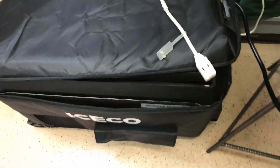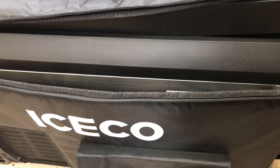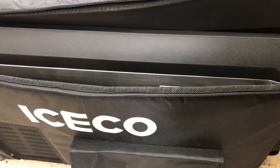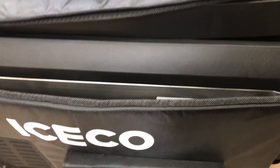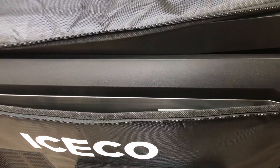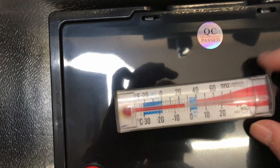Now I've got the battery in an IceCo refrigerator to test the low temperature cutoff. Other YouTube testers spray duster on the sensor or take the battery apart and put the sensor in ice water, but you don't really know the exact temperature. In my opinion that test doesn't tell you much. The important part is not to charge the battery at or below 32°F (0°C). I've had it in the freezer and it's showing about 24–26°F.